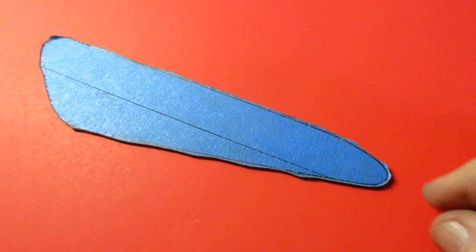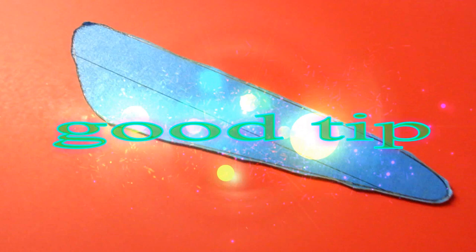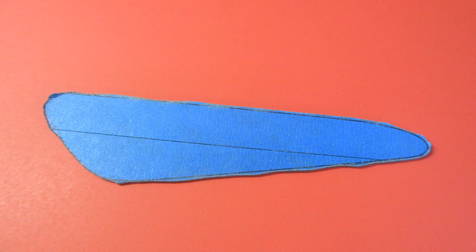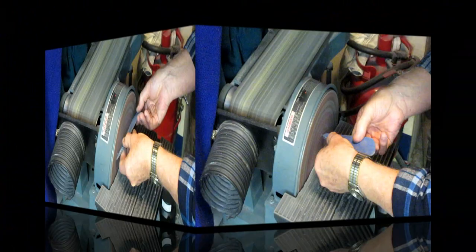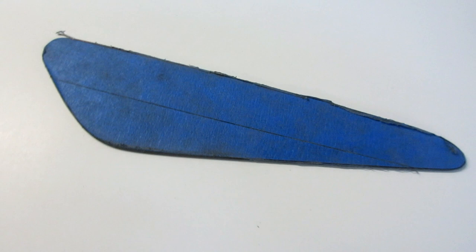By this time the blade is already starting to get dull — you get these wiggles — but that's why we leave that last little bit of material and do the final fit with the belt sander. That is a very good tip. If you use the high-speed setting, the blade doesn't cut through cleanly — it burns through, and the life of the blade gets cut to nothing.